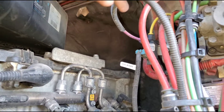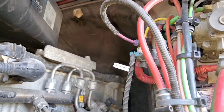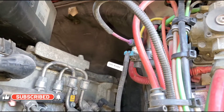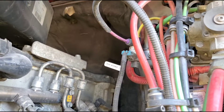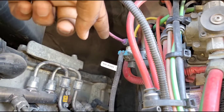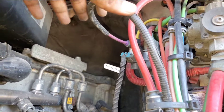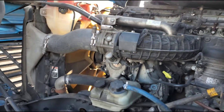It's okay if the fan keeps running in continuous mode, because your truck will not overheat — though in very cold weather your engine may run too cool and you won't have heat inside. But in hot weather it's good to have the fan on and you can reach wherever you need to go, though you will burn some extra fuel. You can disconnect the sensor switch or disconnect this airline — bend it off — and your fan will stay on all the time until you reach the nearest repair shop.